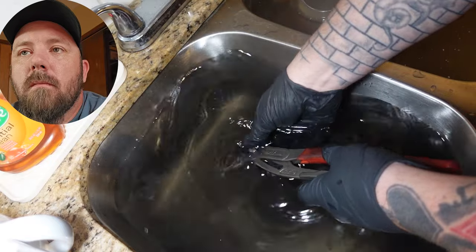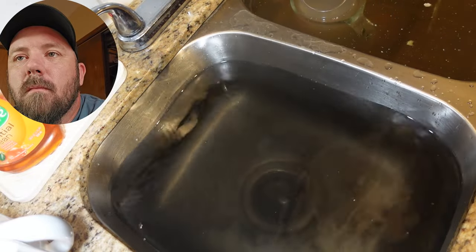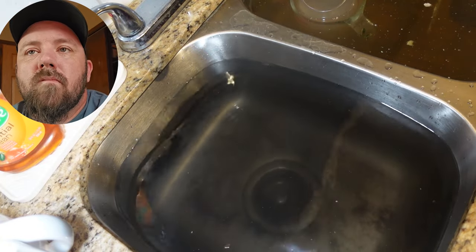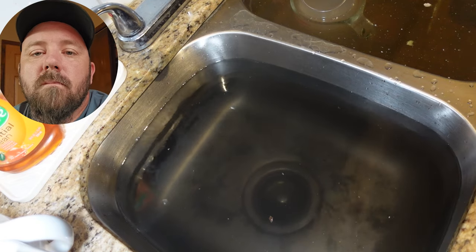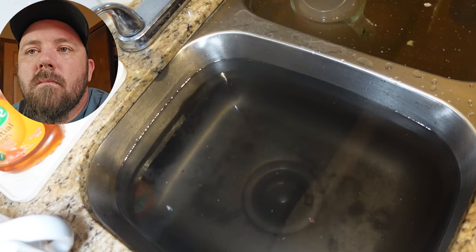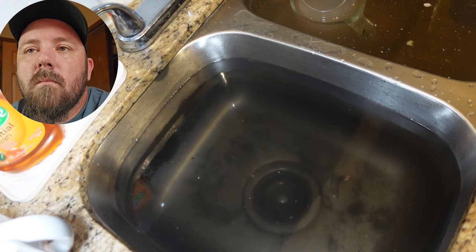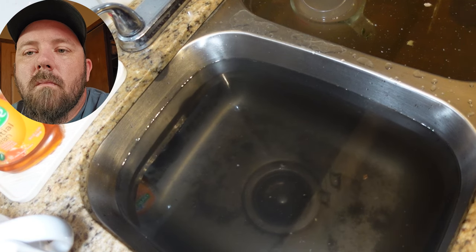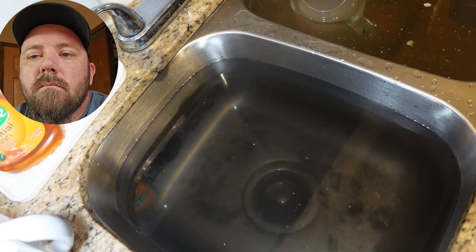At the place I was living in Toronto — we go there all the time, I was there a couple nights ago. This was about 15 years ago. The toilet kept clogging, I'd plunge it and then it started coming up in the bathroom. Yeah, because the bathroom sink, the toilet, and the bathtub are all tied in on one line. Typically if the main drain — the stack itself — is backed up, you may see your toilet bubble and gurgle, then it will start rising up in the bathtub as well. When you were plunging it you were basically pushing the problem just past the toilet line where it ties into the bathtub and the sink — that's why it was coming out of the bathtub. The guy came up and poured hot water and I think Windex down it. Was it fine? It was not.